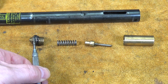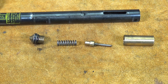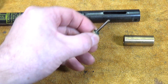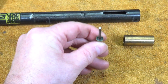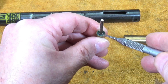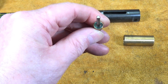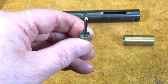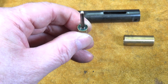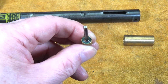Now you get these two seals in the seal kit, and I will be replacing those. But what certainly on the 761 anyway, is this. Now I don't know how well you can see this, but right inside there, that horrible green mucky thing used to be a seal, and that's just crumbling away, which is exactly what it did inside the 761. So I'm going to hoik all that out and replace that with an O-ring, and replace those two and put it all back together, and we should be good to go.